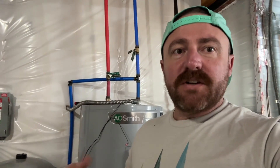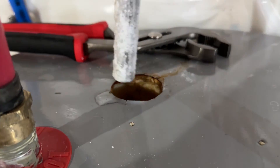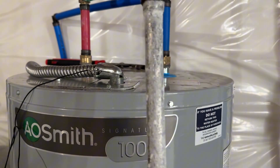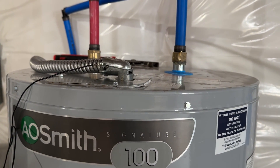So I started doing some research and it turns out that the anode rod — this guy right here — is the culprit. This is called an anode rod. You can see a bunch of gross stuff on it. I took this out a few weeks ago and replaced it with what I'm going to show you guys today. What happens is this anode rod goes in this hole, and instead of the inside of your hot water heater corroding, it is basically the sacrificial tool. I had no clue that all hot water heaters had these anode rods until you need to replace one.